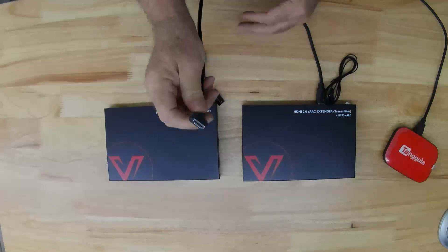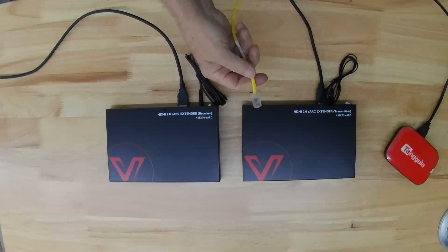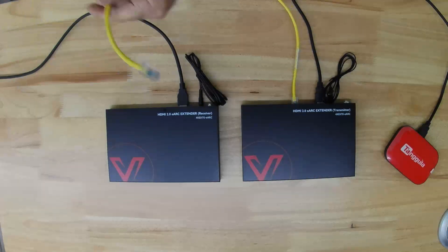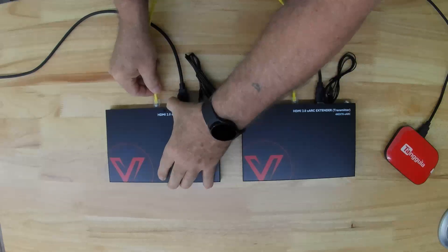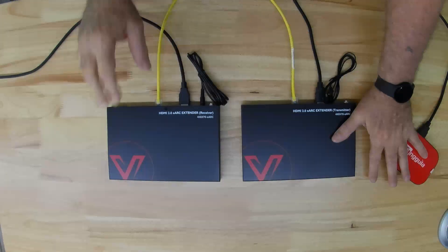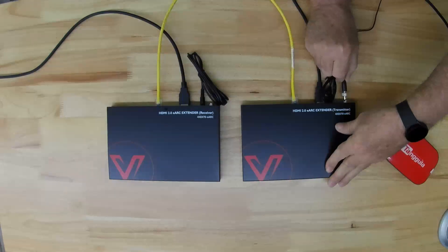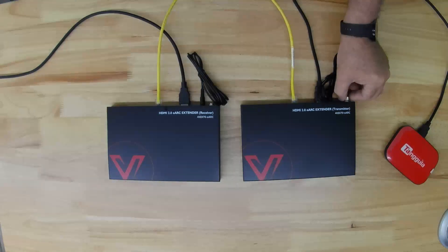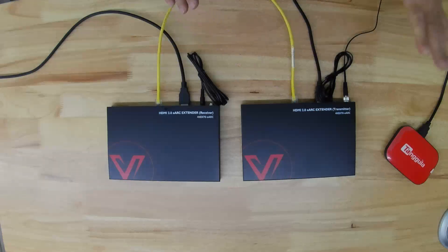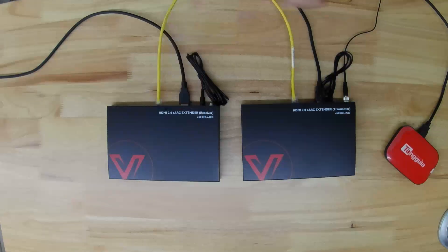Get your HDMI cable — this cable is going to run to your TV. Now this is a CAT cable which you click into this one and get the other end to click into that one. So now the two units are connected together and whatever is being seen on one side will be seen on the other in full 4K. Last but not least, hook up your power to the transmitter side only, turn it on so it stays nice and tight, and this powers up the receiver through the cable. You only have the one power source at the source side.